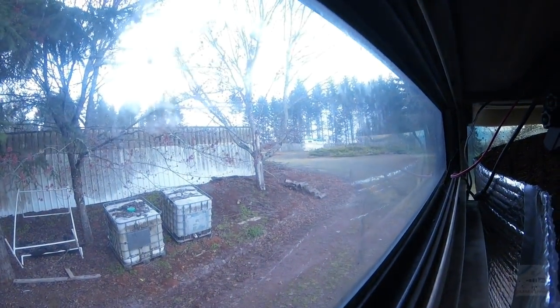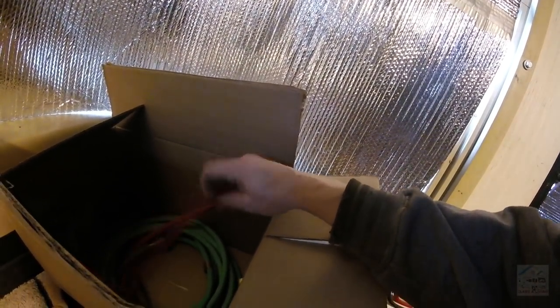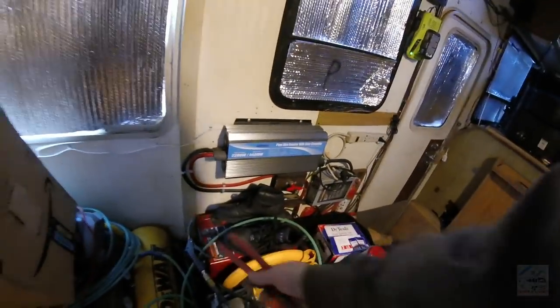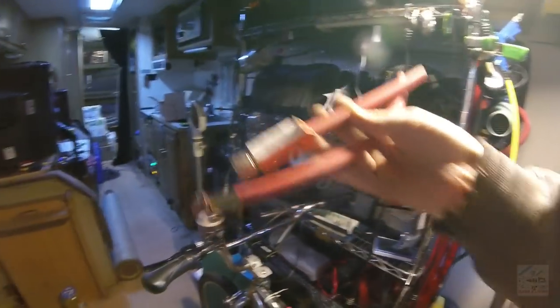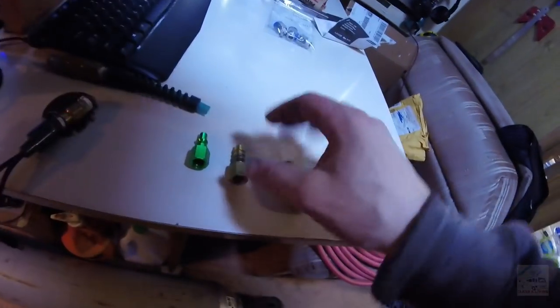It just started pouring. I'm in the middle of a project here for the welder. I've had this short, like three-foot hose for the longest time — it's a Goodyear acetylene hose. I got it from Air Gas; I think they even put it together for me for my shielding gas, my argon CO2 mix. I had some torch hoses and decided to lengthen this whole thing, so since I had barbed fittings on that Goodyear hose that Air Gas gave me, I was able to take one and slip it right over.